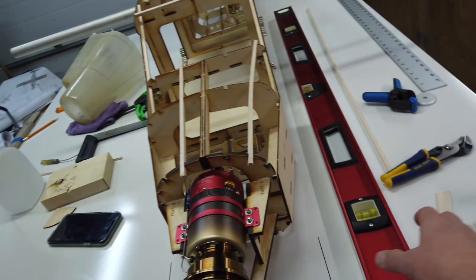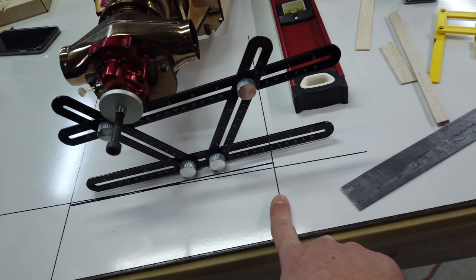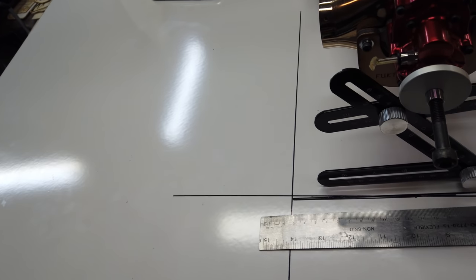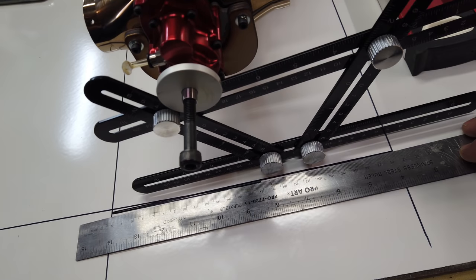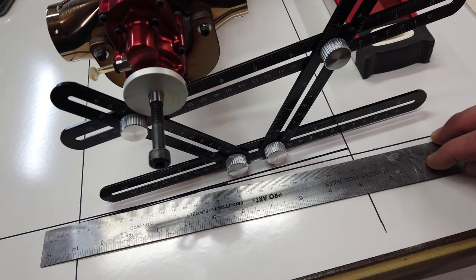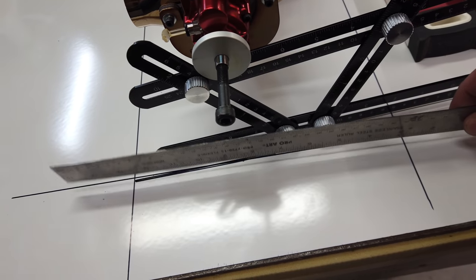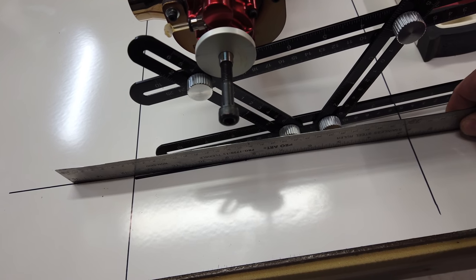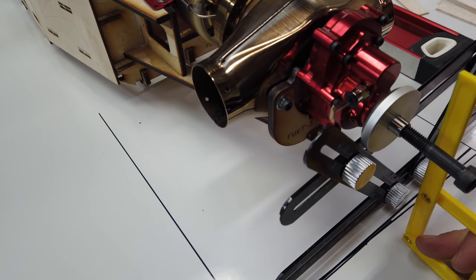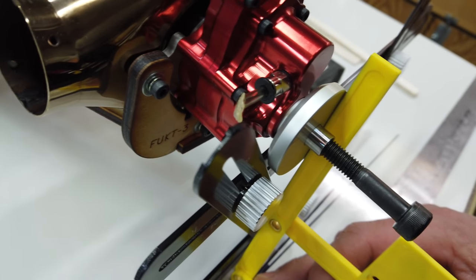The fuselage is on the table with magnets inserted everywhere to hold it in place. We take our straight edge and level and run that on both sides of the fuselage, transfer the marks to the front so we've got our square marks. Then we take our square and draw a line across from line to line — that's our zero — then we add our two degrees and draw a second line for our thrust angle. Then we can take our angle finder and check against the prop washer to set our three degrees of down.